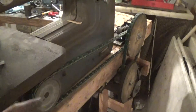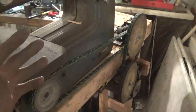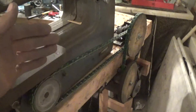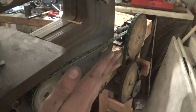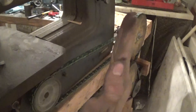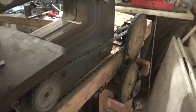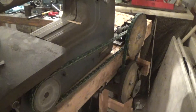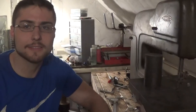The biggest thing with this build is making sure your pulleys are aligned well so the belts stay on track. Also, when you tighten your pulleys from the tensioner, you don't want any flexing, because that can cause the pulley to flex sideways and throw the belt off. The tensioner mechanism has to be pretty steady, but when you get it right it really works great.